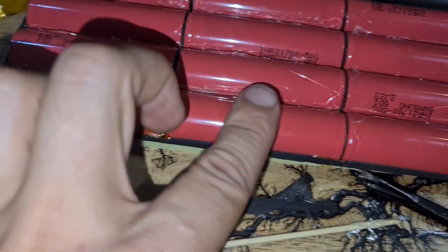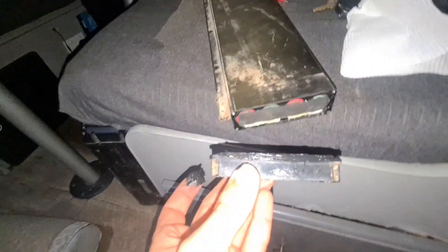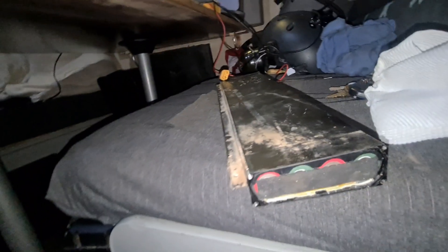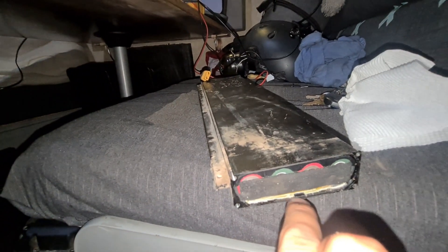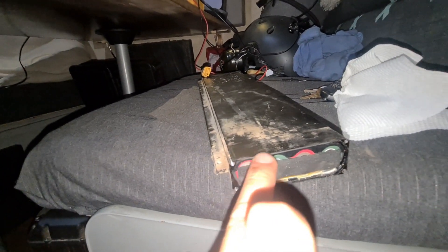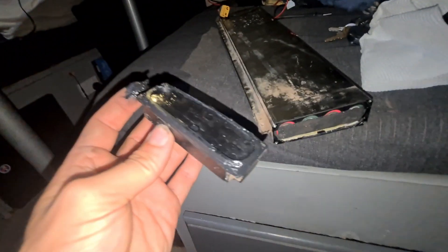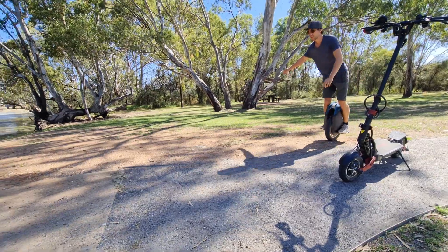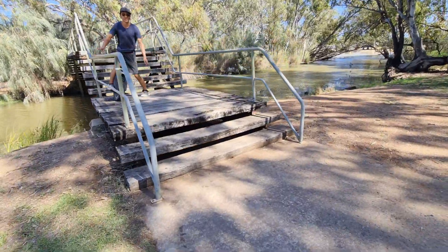That looks a lot better. I'm happy with that result. So whilst I'm putting this back on I figured I'll take this opportunity to do a bit of extra silicon and seal it back up a little extra, because it looks like it did have some kind of silicone sealant on it. So if you ever have to do this, make sure you put some sort of waterproofing back on — even though it looked like on the actual board it had that clear waterproof layer. Extra is always best. Once I fixed the pack, did a few jumps, went to the skate park, rode up a couple stairs, and it's solid. So if this helps you, like, subscribe, and I'll see you in the next one.